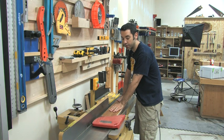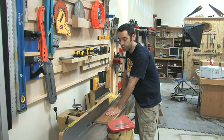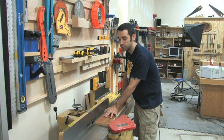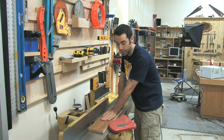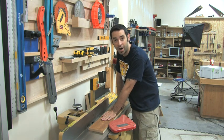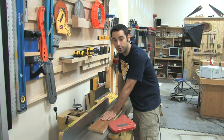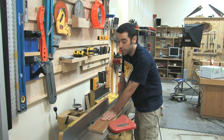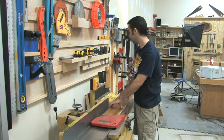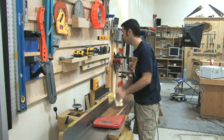As you're pushing the material through, let's say you're using your bare hands, like our example on the website — you're pushing this through. Now if you had asked yourself ahead of time, should this board get caught and slide out of my hands, what's going to happen? Where's my body weight going to go? If you ask yourself that question, you'll find out that your hand's going to go right into the jointer blades. Very dangerous. So you don't want to do that. Obviously, things like these paddles are great for that as well.